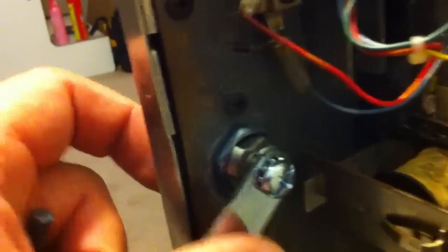When drilling out, the object is to basically remove the locking mechanism from the back of the lock. We're going to be running this drill bit through this lock. To give you an idea of what we're going to do, let's take a look at the back side of a good lock here. You can see the back side of the lock has just a screw that holds this little locking lever in place. We're going to be drilling through the lock and actually through the screw until it breaks off, and then we can open the door freely.